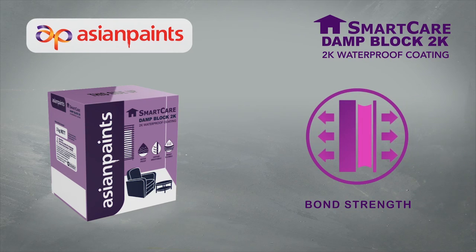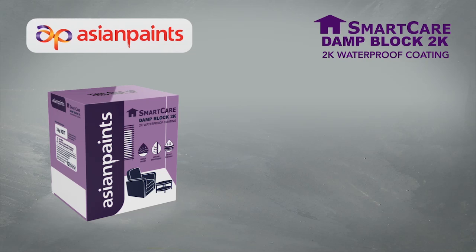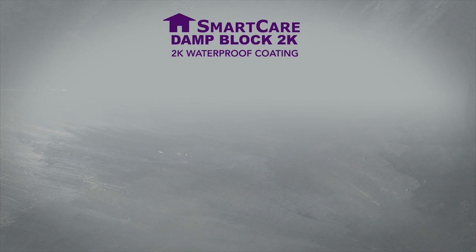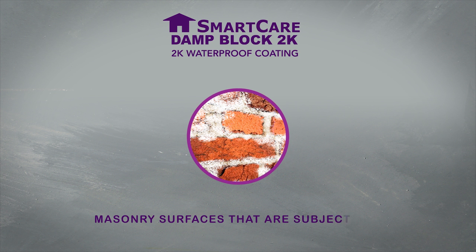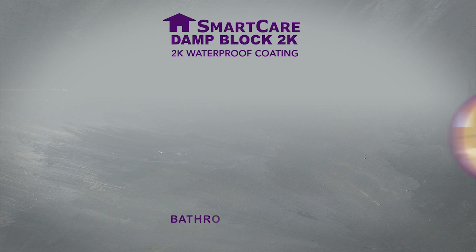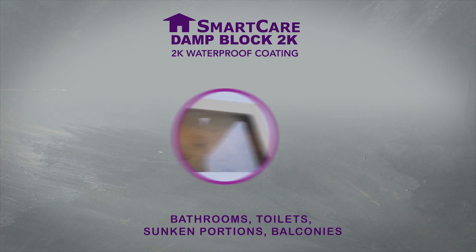A two-component acrylic polymer-modified cementitious high-performance coating, which can be used for both positive and negative side waterproofing due to its excellent bonding, good waterproofing, and unmatched resistance to hydrostatic pressure. Because of its superior properties, it can be used in a host of areas for waterproofing purposes, including masonry surfaces that are subjected to damage due to moisture or efflorescence, bathrooms, toilets, sunken portions, balconies, and swimming pools.